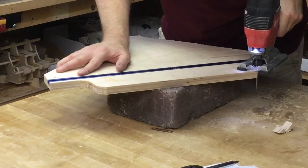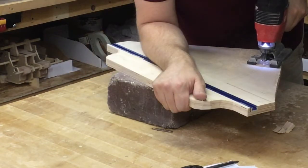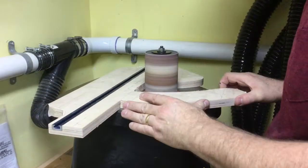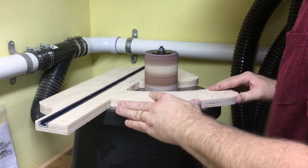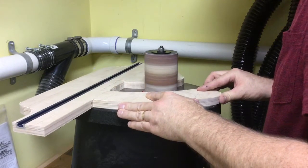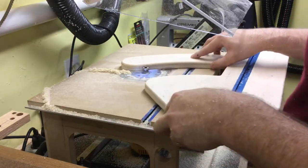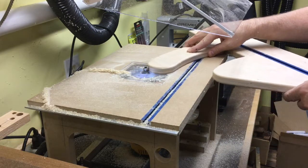They say that form follows function, and this board does have a pretty weird shape, but there's a reason for all of those weird protrusions. This funny shape took a long time to sand right, using a couple of different machines, and also a little bit of hand sanding in a couple of the corners where nothing else could reach. And finally, to make all the corners nice and pretty and smooth, I am using a 3/16 roundover bit here on all of the edges.